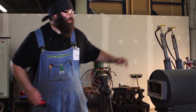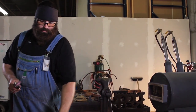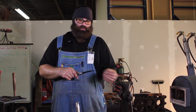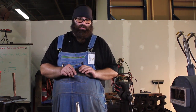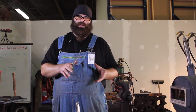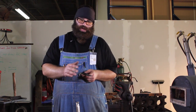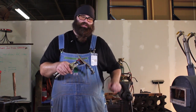I'm going to light up the forge and we'll talk a little bit about what's going on here. What I've got here is just an ordinary magnet, and of course magnets stick to steel. When we heat treat, we are going to check for critical temperature of the steel. At critical temperature, steel loses its magnetic properties. That's what tells us all those atoms are swimming around in there and they're in a kind of solid liquid state. When this magnet does not stick to our blade anymore, I know I've reached critical temperature.